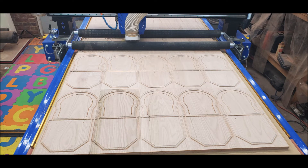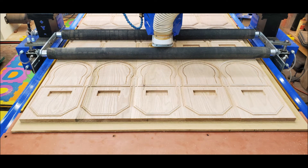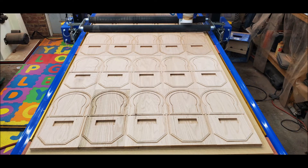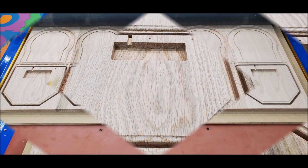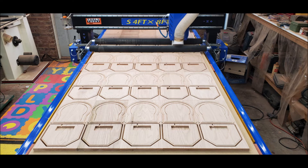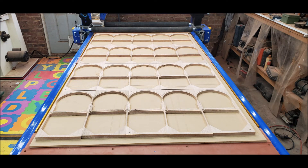My material was set up at 20-inch lengths, which was causing me a little concern, but they had already been sectioned up to be used in the jig I had previously been using. One thing I learned after I cut these: as the cuts started taking place and removing more material, I noticed a little bit of movement on the very last cut because of the vacuum system and all the open areas. So on the next series of lamp bases, I sectioned the vacuum zones like a wave — I had everything on when I set the material, then used sections 1 and 2 for my first two cuts. As section 1 finished up, I turned section 1 off and turned on section 3, which left sections 2 and 3 on, and that greatly increased the suction and held everything in place without any movement.